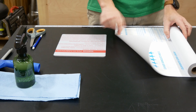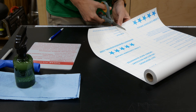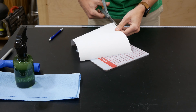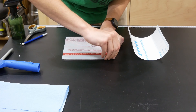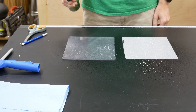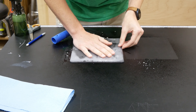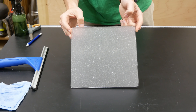I'm using a frosted film to get the frosted glass look. I unrolled the film, laid the glass on top, and marked the edges. I cut the film inside of my marked lines as I want the film to be smaller than the glass panel. I checked it against the glass and trimmed it where it was going to overhang, then rounded the corners of the film as well. I removed the protective backing from both the glass and the frosted film and sprayed both liberally with soapy water. I flipped the film onto the glass and used a squeegee to push the water out from underneath it. The film is adjustable at first but adheres more as the water is pushed out, and once it's dry it looks pretty nice.